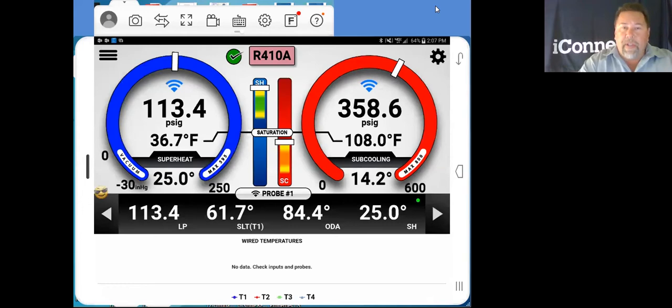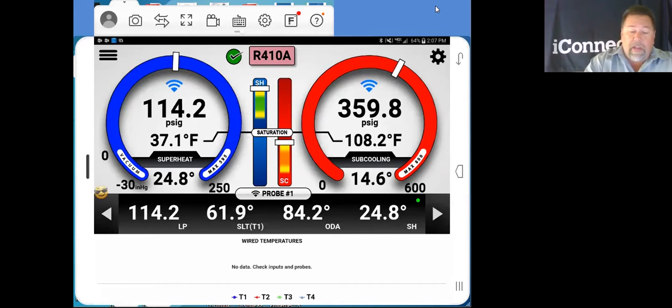We're gauged up on this system. Right now we have no profile. Profile of a system is basically the refrigerant, the metering device, the efficiency, the configuration of the system, whether it's an air conditioner, straight cool, a heat pump, or low temp refrigeration.